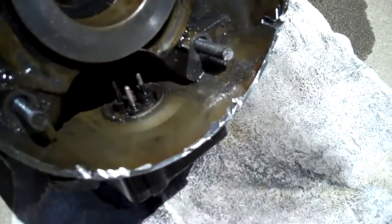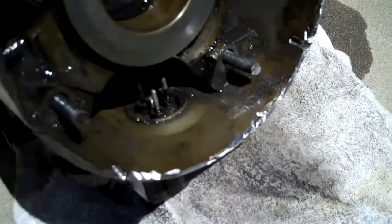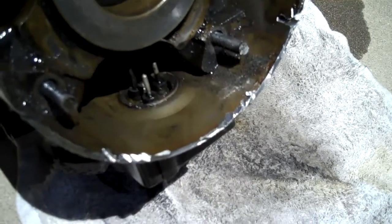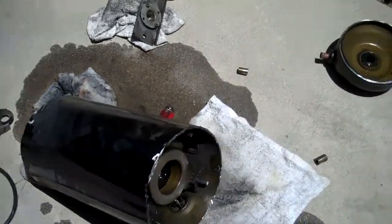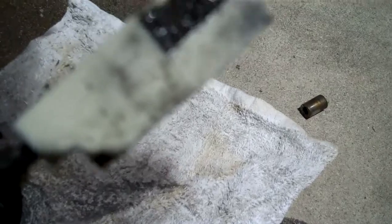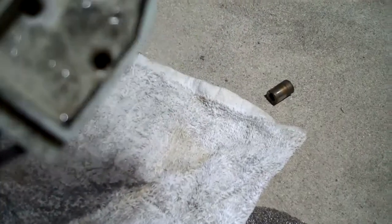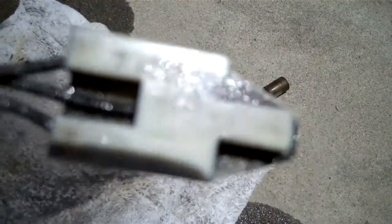Here's one more look at the pins on the inside. The pins on the inside look like the outside now. And here's the plug — this one's made out of plastic too, the plastic plug on the inside. It makes you wonder how many times these burn off. It can cause a grounded compressor or a burned-off terminal with no continuity.